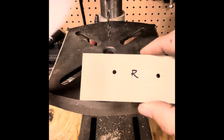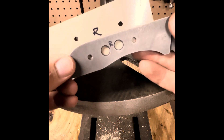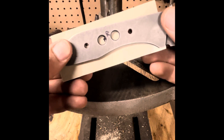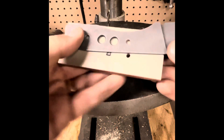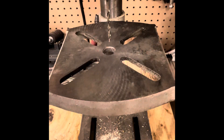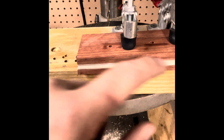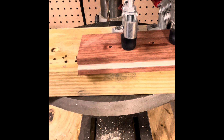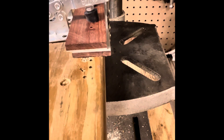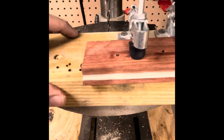We've got the holes drilled and I've marked each one — it may be obvious which goes where, but the lines become blurry another day or week later. When you've got right and right marked, they want to go together and should line right up. I've sandwiched them together — make sure they are completely flat with no gap, because even a millimeter of gap up against the blade will show. I've got them staggered slightly to try to get the grain structure to match up on both sides, then locked them down so they stay sturdy and straight.